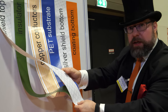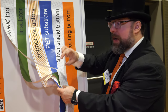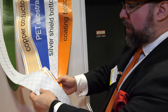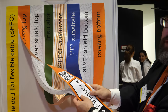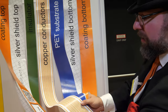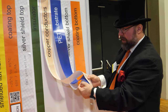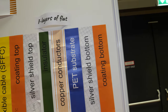So that's all done in one go? Yes. Then the magic starts — we drill holes and connect the top and bottom shielding to the two outer traces of the copper layer. Then we print the cover layers on top and bottom of the cable, and screen print the graphics for the user. That's seven layers, all done flat and flexible in one process.